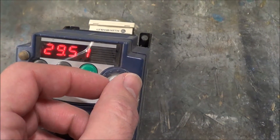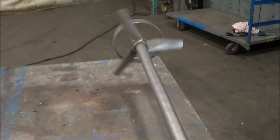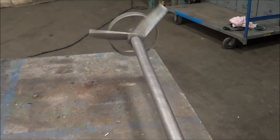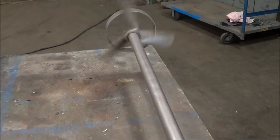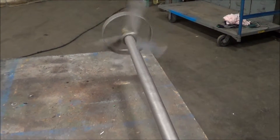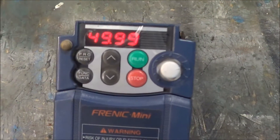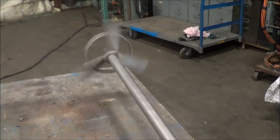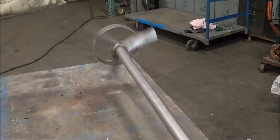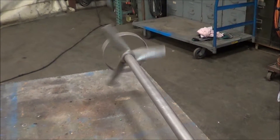The VFDs can be programmed in a multitude of different applications and speed adjustments — very useful for applications with small mixer motors, and also on shutdowns. It will slow it down very slowly, just like a soft start or a soft stop on a lot of motor applications.